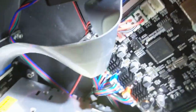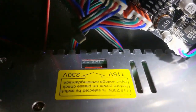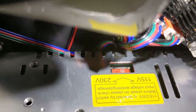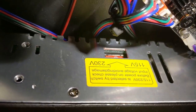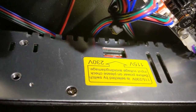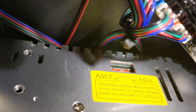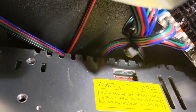There's another caveat for you. You have to take the bottom off of the case in order to get to the power supply to check what voltage it's set at. This one is set to 230 right now and I need 110. Trying to take the screws off the bottom rounded out the wrench they sent — the 2.5mm — fortunately I have a good stock of Allen wrenches to get the case apart.